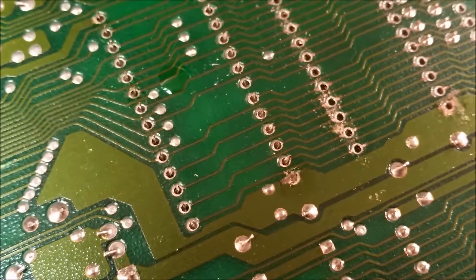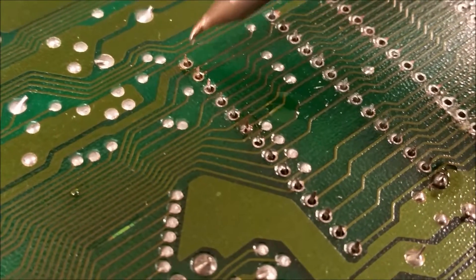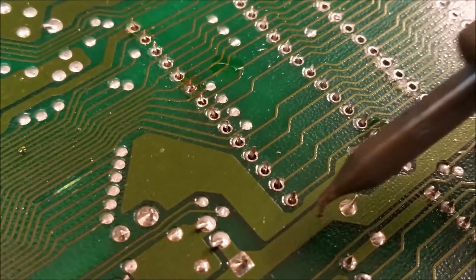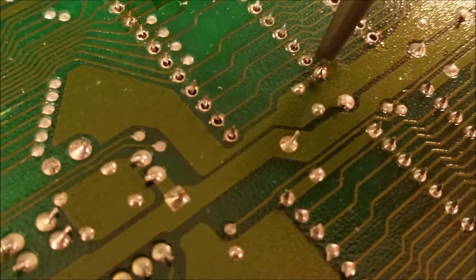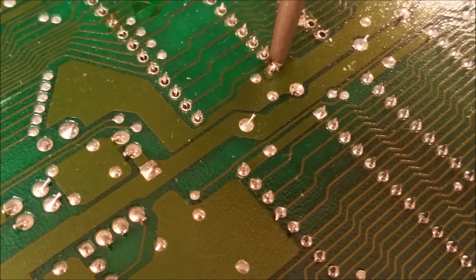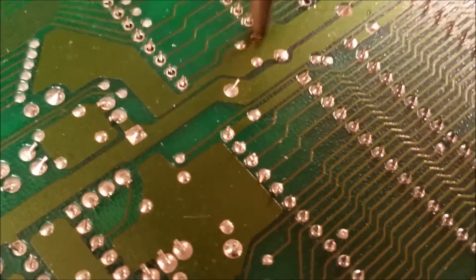Let me refill that one and suck it out. Two of the pins were giving me a little bit of a problem. I went ahead and just dropped a bunch of solder on it — you can typically just touch them and tell if they're free or not. Sometimes if there's just a little tiny bridge it'll snap when you do that and break free. Let me get the big solder sucker and set it on there. I'll just let it cook for a little bit — there we go, now let's see if that'll do.